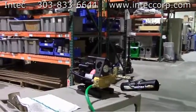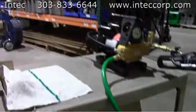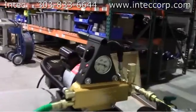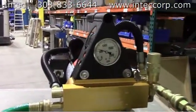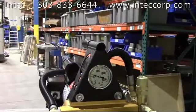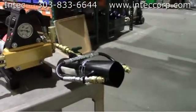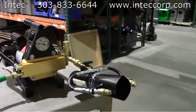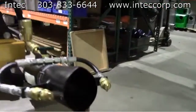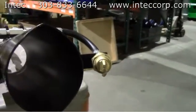Here's a video of the pump itself. I have the pump set up here coming in with a garden hose just to feed it — it can also go suction out of a reservoir if you'd like. You can see the gauge right here, 0 to 2000. The sweet spot is 800 to 1000, right in that range, and I have it set up with a fairly typical nozzle for this type of application.